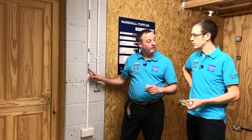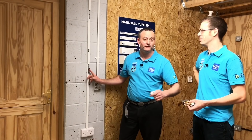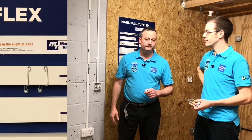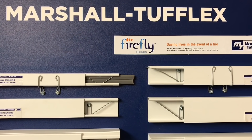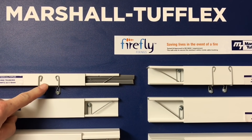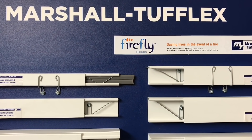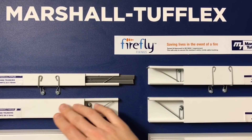It's a little bit of personal preference but also keeping an eye on best practice. We're going to bring the camera in closer because there was another question about whether you can get two 2.5mm cables behind the firefly clip. We'll also run through again those over-clips that can be used as a retrofit on trunking. We've got the mini trunking here where we have both the over-clip and the internal clips to choose from.